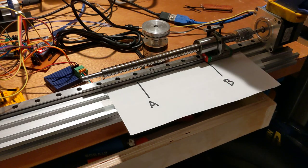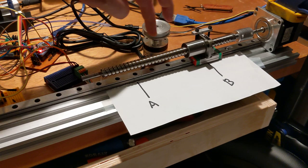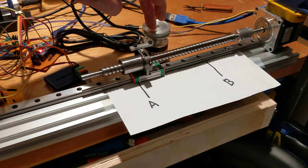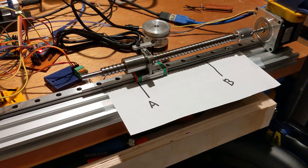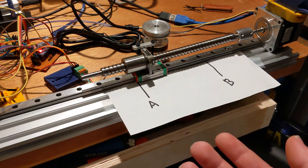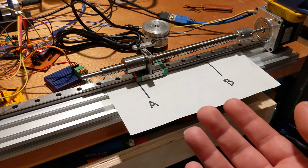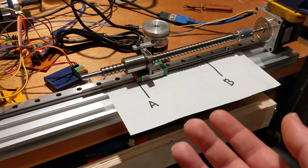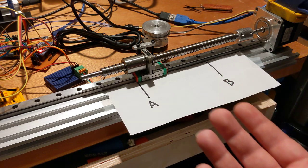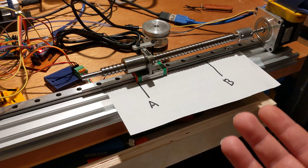So, I know my hand's in the light, of course, because that's how this stuff works. But when you get up to speed, there's a delay, and so the other component here is the jog cancel command and the latencies involved. It doesn't seem to me like the jog cancel command is instantaneous. There is a bit of latency, and there's a calculation that you can do to try to figure out the latency.